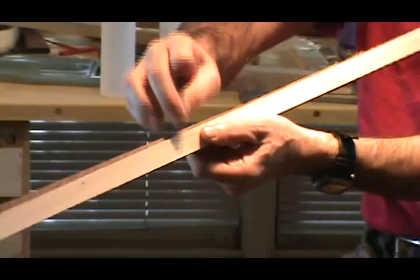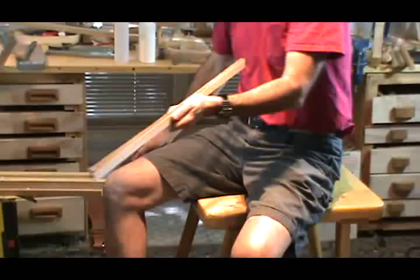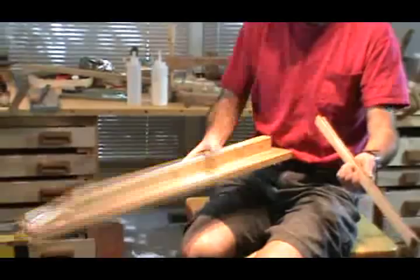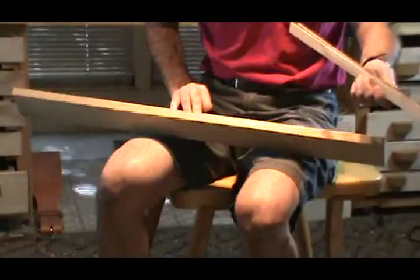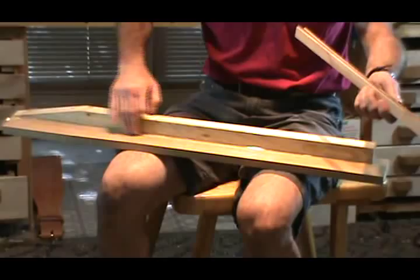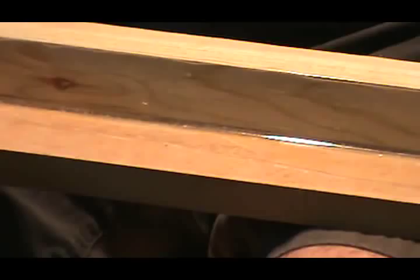To illustrate this, you can make this any size you want to suit your jig or your working environment. This piece happens to be about 7/8ths of an inch wide by 27 inches long, by whatever the thickness of your veneer is. Usually my laminates come out to about a half inch thick by 12.5 millimeters. The gluing jig is basically a scrap piece of a 2x4 that's been cut in half on a base of 3/4 inch piece of MDF, and each face has a piece of packing tape so that when you're doing your veneer glue-up nothing winds up sticking. Line the inside face with packing tape and the bottom piece as well so you have no extra glue to scrape off.